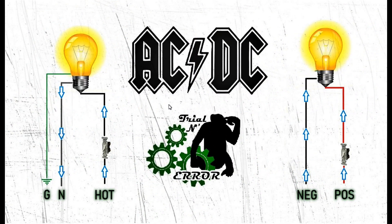Let's start off with a real basic, simplified overview of AC and DC current. DC is found in things like cars at 12 volts, where you have a positive and a negative going directly to whatever device you're trying to power. The house, however, runs on AC — alternating current. A simplified way of looking at that is your hot comes in, goes through the fixture or appliance, comes back out through the neutral, and then you have a ground for protection.